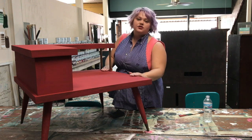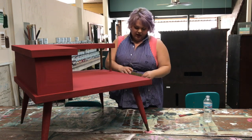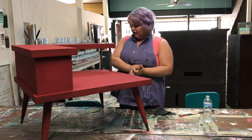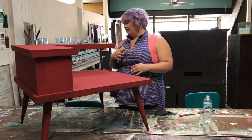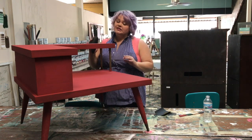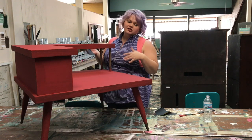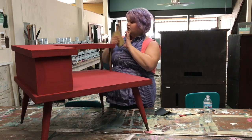The whole surface has dried now and I'm going to hit it all with 600 grit sandpaper again. That will smooth out any of the brush strokes. You really want to go really lightly — you're not really trying to take the finish off, but in doing this you will take some of it off. This is the most tedious of finishes and it will look pretty scary on red, but it will feel like butter smooth in the end.